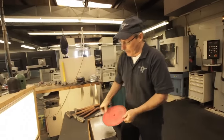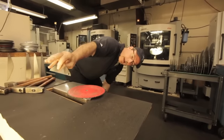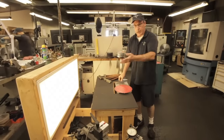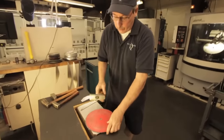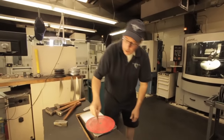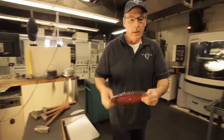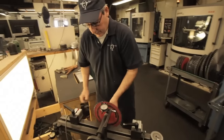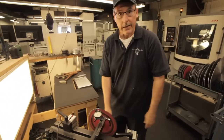I would come over here with my straight edge and look at that area. With my light in the background, I could say, yes, there's a bump right there — you could see there's a little ridge in the saw blade. I take my hammer, find where that ridge is, and just do a little tap, tap, tap. Check it again with my straight edge. It looks pretty good, and then as a double check, I want to put it back on the runout stand and make sure I did get the runout out and it's perfect.